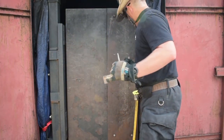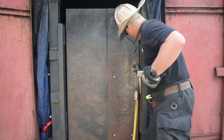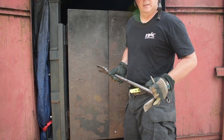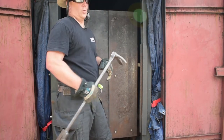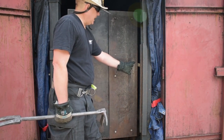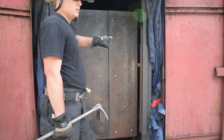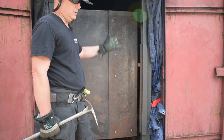Remember, we're still going bevel towards the jam. I'm not going to be able to get this in there good enough without a partner to force it. So get one more little force with the bevel towards the jam, and then the door broke. If the door didn't break, we'll go back bevel towards the door - adze down, 3-point, and the door's going to pop. Those are your progressions: bevel towards the door to get your initial gap, stick the axe in, bevel towards the jam to pry the door back and the jam away, drive the axe in, one more good force down, flip the tool over, force it again. If the door's still not going, go to adze, rolling it down for the 15-to-1 mechanical advantage - the door's done.